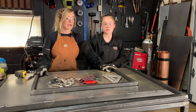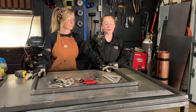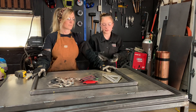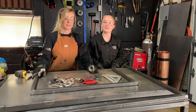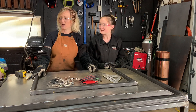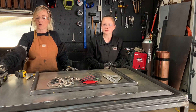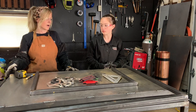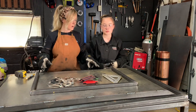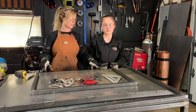Our rails for the sheet metal rack are complete. We finished it off with cleaning up the corners - all but one, which I kept as a reminder of how far Briley has come in welding. We'll be able to look at it years down the road. For the main rail going through the center, we marked that at eleven and a quarter to the center of the one inch by one inch square tubing, and then nine and a half inches in from each corner so the lower rail sets on the outside.